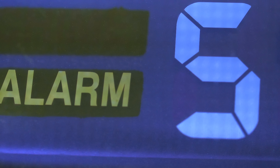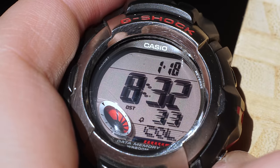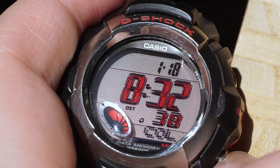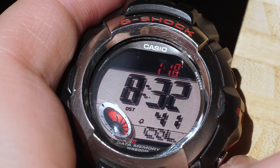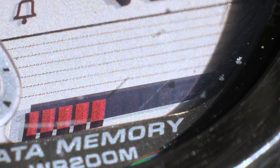That's it concerning pigmented liquid crystals, if that's what it is. This display can change its color from red to black or transparent, achieved by placing two LCDs between the polarizers, giving you the fancy option to change the color scheme. The red color appears when overlapping segments are active. You'd think that two active LCDs would make it transparent again, but for some reason when both are active, only red light passes.